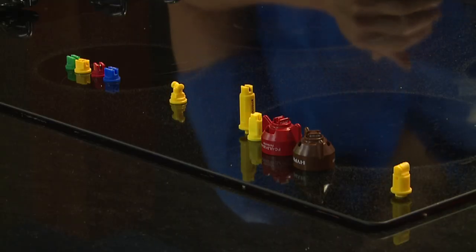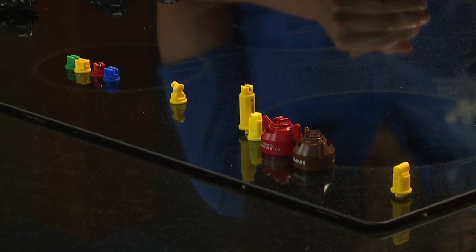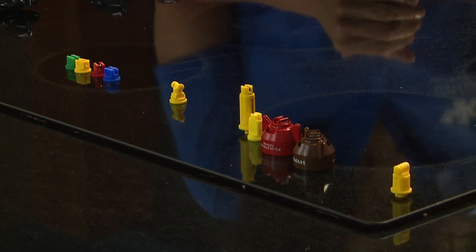The biggest difference between the traditional nozzles and this other style is single-stage versus two-stage. Traditional flat fan nozzles are single-stage — one hole does two jobs: it meters the amount of product coming out and shapes the flat fan spray pattern. With these single-stage nozzles, pressure plays a large factor in droplet size — higher pressure gives smaller droplets, lower pressure gives bigger droplets.